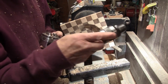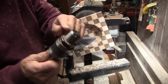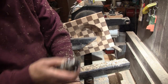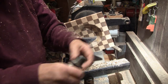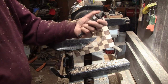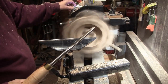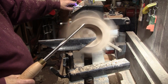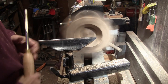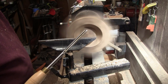I'll show you that arbor — I have it out of the chuck now. That's what it looks like — that's a ball bearing, there are the threads, it screws into the back. You can make wooden blocks and use them for stabilizing pieces — I've done all kinds of things with it and find it very useful. Still using a half-inch bowl gouge. It's very well balanced and it looks like the inside was very centered. We'll go ahead and do about 725 RPM.